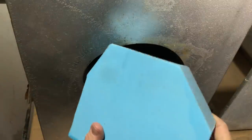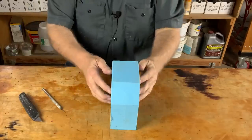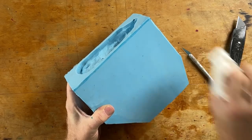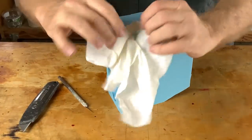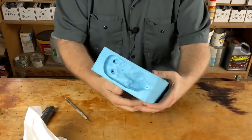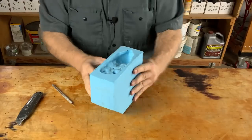Not only do we have to build a cradle for this mold, we have another problem — it doesn't fit in the tank. So I'm thinking it's time to do a little bit of mold sculpting. We're going to make some cuts. But I just noticed something — I've been pouring this rubber for 30 years and it's doing something I've never ever seen it do before. There's a little line of uncured hardener running around the rim of the mold. I've never seen that before. Just wiping it off — that's weird. It's helpful to know your materials, but even then, sometimes they'll just do weird stuff. Mysteries abound.